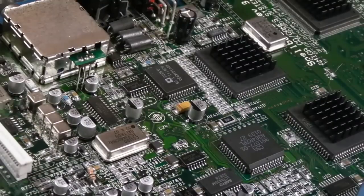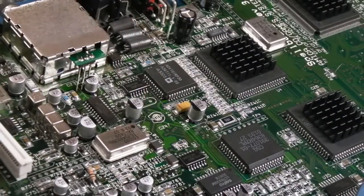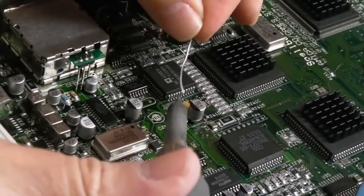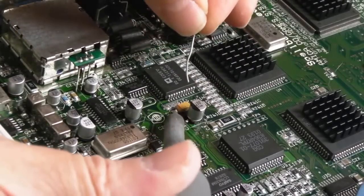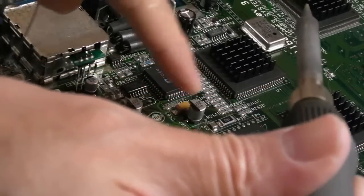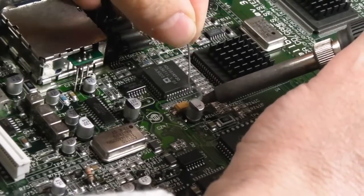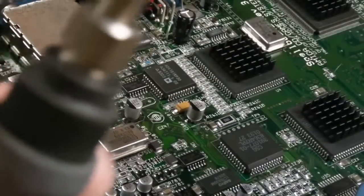So with tantalums, I think the band, as you can see, it's pointing down towards the joystick ports here. That indicates the positive rather than the negative. I always found that confusing. I think that's why tantalums would be different to other capacitors, where the band here designates the negative, although it might designate the positive on SMD ones. You know what I'm talking about? I'm talking about the stripe on the side of an electrolytic can that indicates the negative. So I'm shedding a bit of solder to each side there.